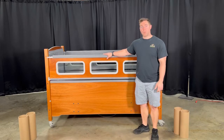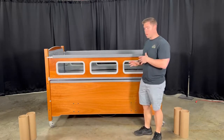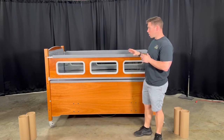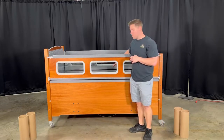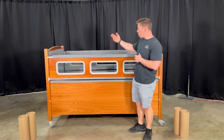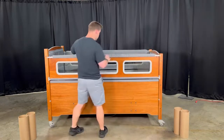This right here is a moving guide — basically what the bed will look like when you come to it. What you want to do first is get the frame at its lowest position and make sure that the head and foot are not articulated at all. Unplug the power, get it out of the way, and take all of the safety rails and the mattress off to get it down to bare bones.